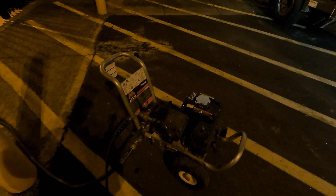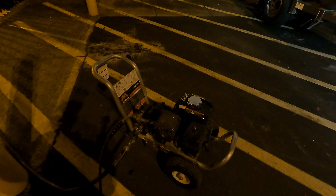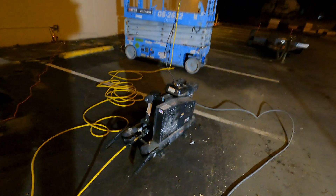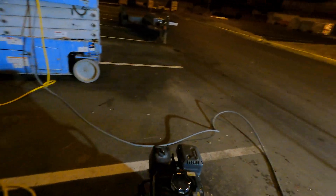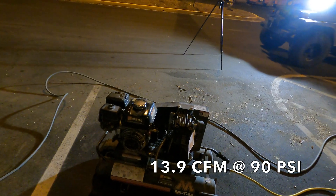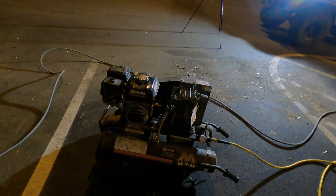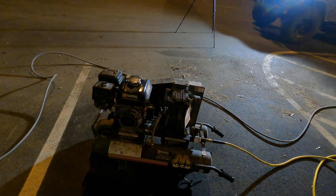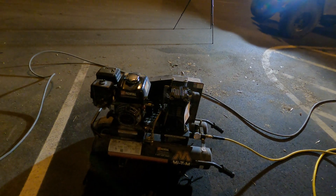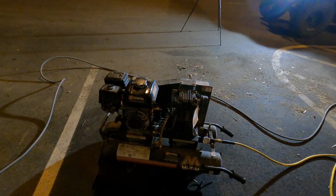Alright, so let me show you what we're dealing with. I've got a 2700 psi pressure washer, but the more important number for making snow is the gallons per minute that it puts out — this one's 2.4. The more gallons per minute you have, the more snow you can make, but also the more air you're going to need. I've got an 11 or 12 cubic feet per minute air compressor. The gasoline ones have far more GPM than the electric ones. You can get by on a smaller one, but you may not be able to pump out as much water at one time.